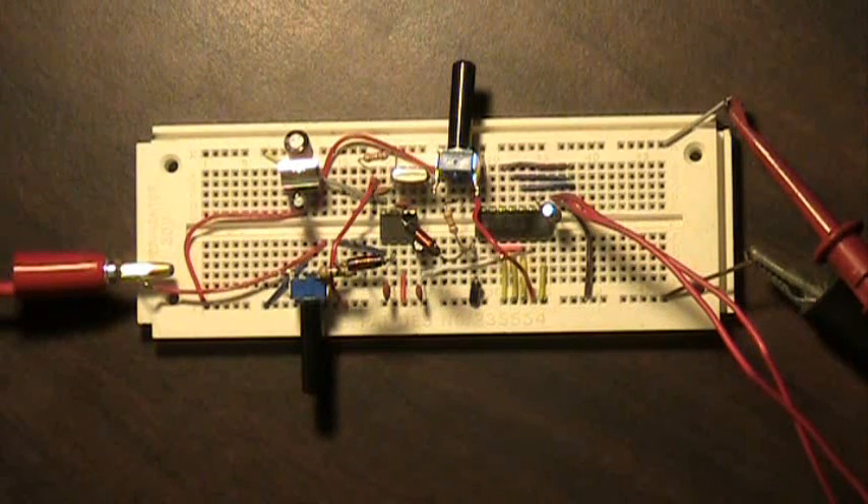Hopefully that gives you some information on this receiver. Some future upgrades that I hope to have include a frequency display using a PIC chip — that would be nice to have on here. Not normally something you'd see on a QRP rig, but using a PIC chip which is fairly low power, I think we could make that work, and it shouldn't impact the battery life of your 9 volt too much. With that, I'll say 73s from KF4KNF. The information is actually in the More QRP Power book that you can get from the ARRL.